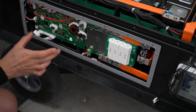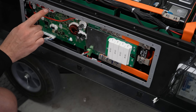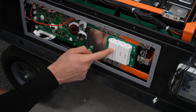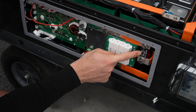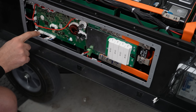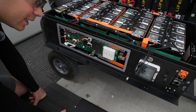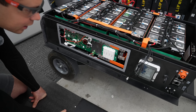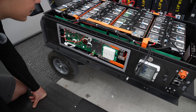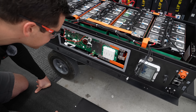The BMS is actually removable — you can disconnect the bus bars, remove some screws, and swap it out without removing the front cover, which is a great serviceability feature. We also have pre-charge resistors, a main fuse rated for 250 amps, wires powering the BMS and heaters, balance cable, screen and communication wires, and the state of charge indicator wire. All the larger components are glued to the board and the whole board has a conformal coating, which is common nowadays but still nice to see.